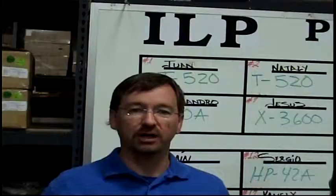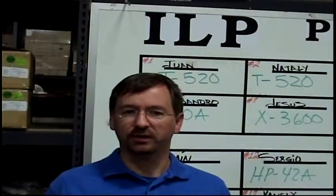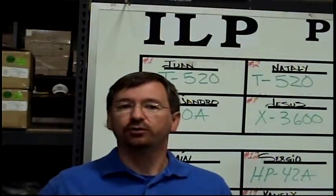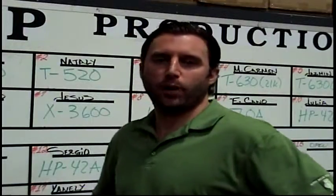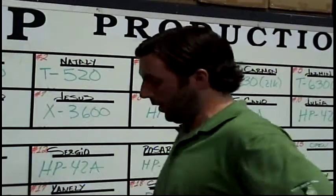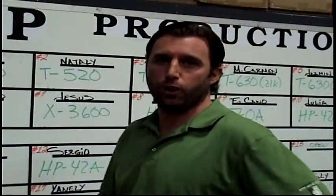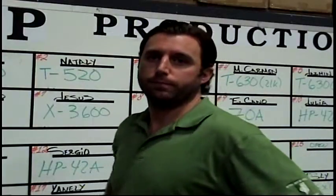So Zach, basically you have a brand new product that you're putting back on the market. You're not drilling and filling, you're not slicing and dicing, you simply have a brand new product that you have replaced all the used or movable parts in. Is that correct? I wouldn't say it's brand new, but it's as close to the OEM as you can get because of what we do. We use a virgin core that's only been used 1 time previously, and we replace all the parts. New toner, new drum, new chip, new OPC, new cleaning blade.